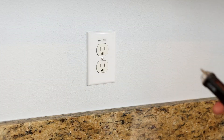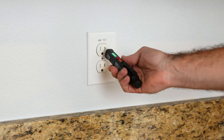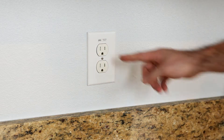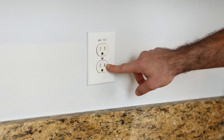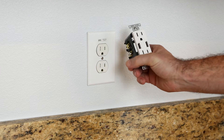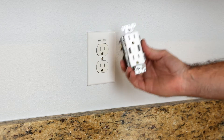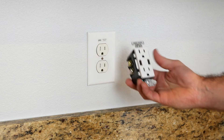I've already turned off the circuit breaker. Now I'm going to go ahead and turn on my tester. No beeping — so we are clear. Another thing to note: if one of these outlets was controlled by a switch, you cannot use this. So if your outlet's bottom one turns on and off by a switch but the other has power all the time, you cannot install this in that place. Just be aware of that.